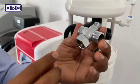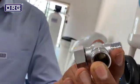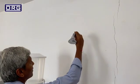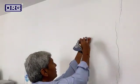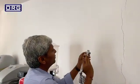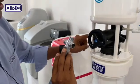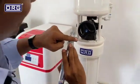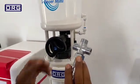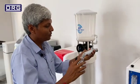For example, if you need soft water in your shower, you have to remove your existing shower — your shower might be installed like this. You just remove the shower, fix this four-way connector here, and put the shower back like this. From this four-way connector, the raw hard water comes from this outlet — give the inlet here. From hard water here to here, the soft water comes from this outlet, connects here, and goes to your final outlet. So you can use it as a shower softener or as a point-of-use in a tap line or any line.